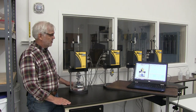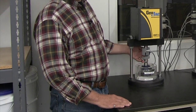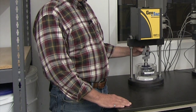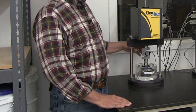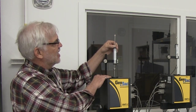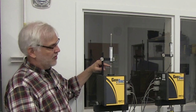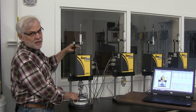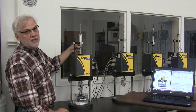We'll be placing our specimen underneath the load cell at the bottom of the loading frame. Just above where our specimen is, is the load cell — a device that measures the force applied to the top of the specimen. Since we know the cross-sectional area of the specimen, we can get the stress applied to it. The other thing we need to measure is the displacement of the specimen as it consolidates. The displacement measuring device at the top measures displacement there, but the piston is connected directly all the way through the load frame, so the displacement at the top is the same as the displacement at the top of the specimen.